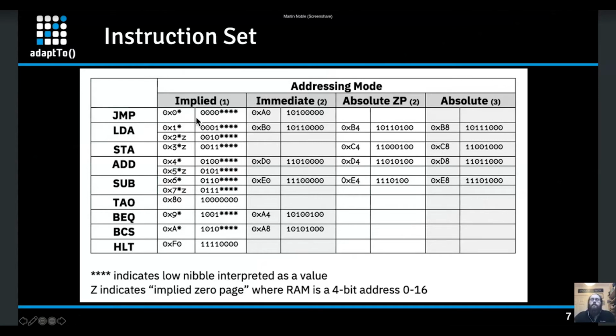The second byte is the place you want to jump to. But to make it so that, for a lot of my simple test programs, actually, I haven't got many lines of code, or I just want to jump back to the beginning, you can cheat a bit and say, if we just split the opcode in half and use the bottom 4 bits as the address, then for certain opcodes, you can either have a 1-byte opcode where the opcode and the data is in the single byte, or you can have a 2-byte opcode or a 3-byte opcode to do more complex addressing, where you want to say opcode plus address or opcode plus 16-bit address and things like that.